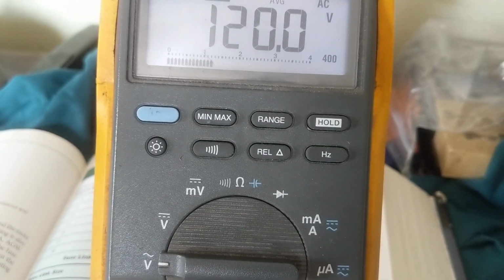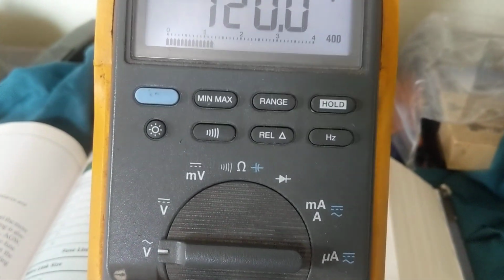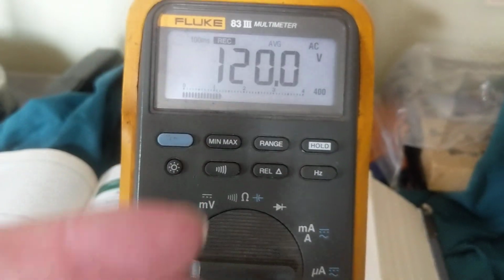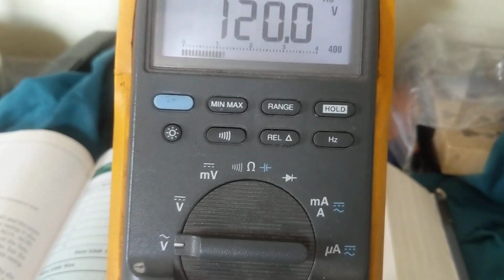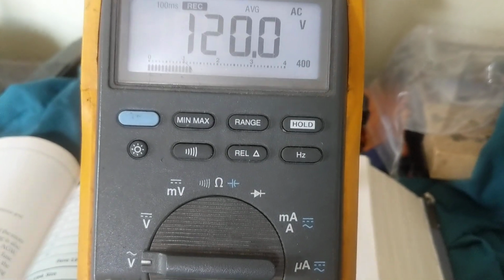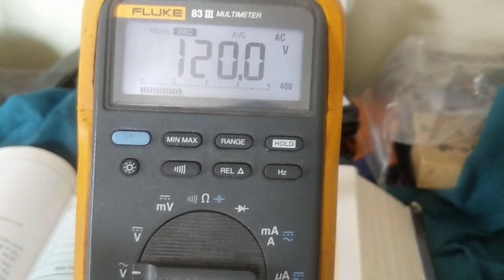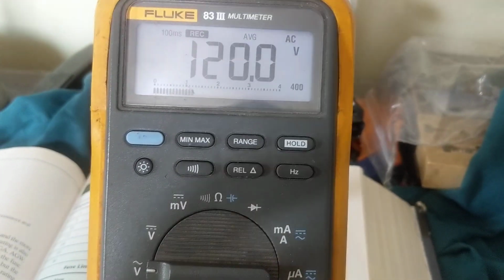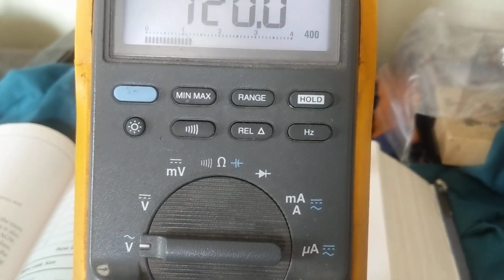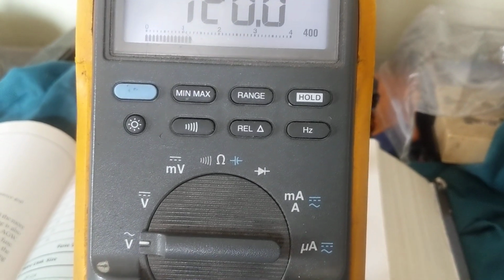And what happens after that? It goes to the alternator. Then you're going to go to about 14 volts. So let's go over the range again: 12.6, 10.5, 10 volts, and that'll be the minimum. So if you want to make sure your battery is correct, using this function on the minimum that I just showed you, you should have about 10.6, 10.5 volts, more than 9.6 volts on your car battery.